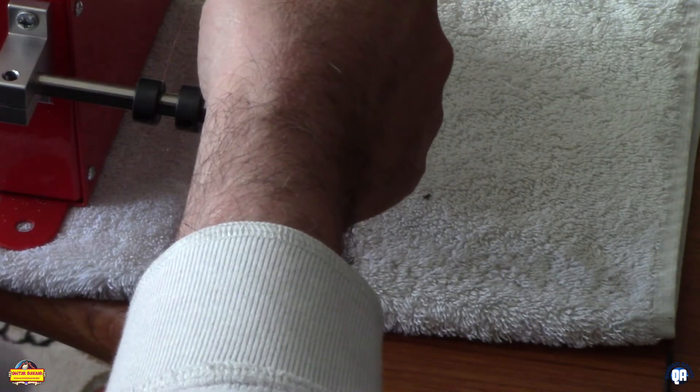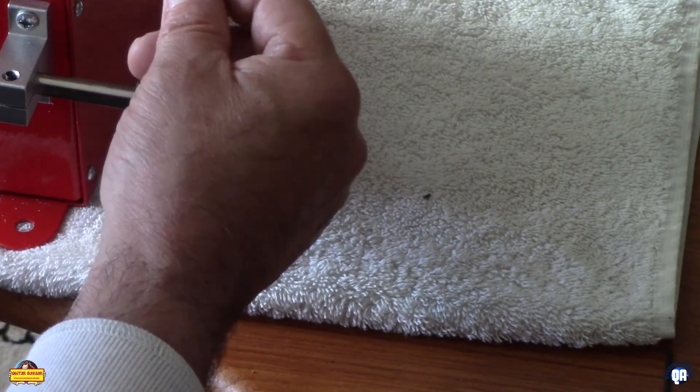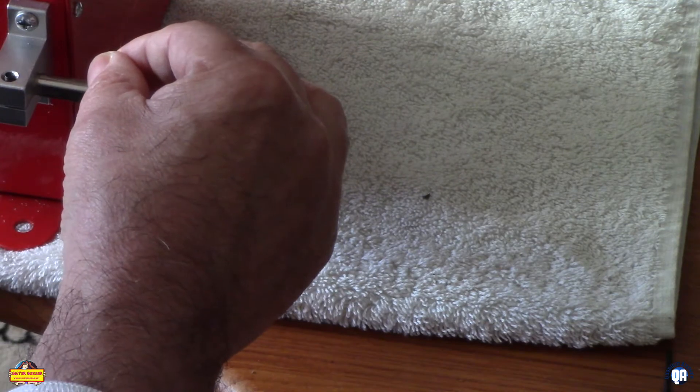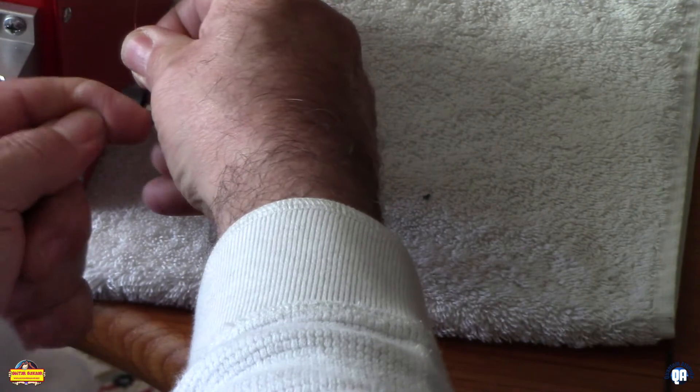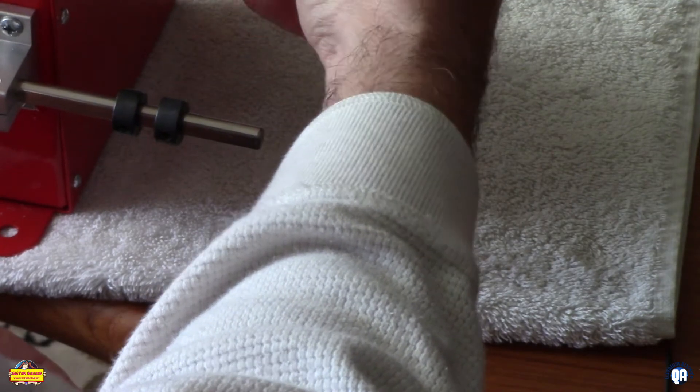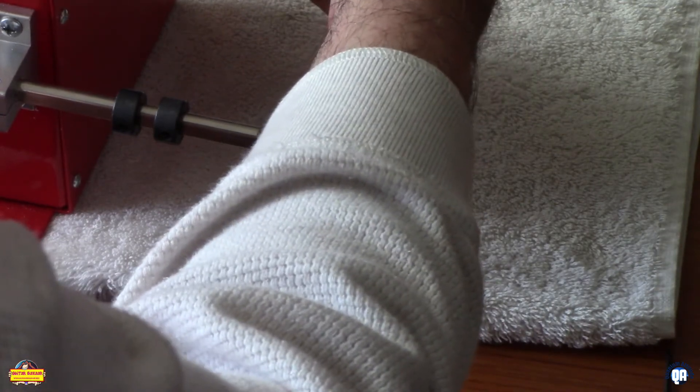We've got it wound. The next thing I like to do is turn it up and take one little piece of tape that I've got ready and tape that wire — just to stop it from popping off and unwinding, which makes it a little easier. I'm going to break the wire right here. What we're going to do is pull the bobbin off — simply unscrew these screws, take the guard off, remove the bobbin, and move over to the bench to show you how to complete this P90 pickup.